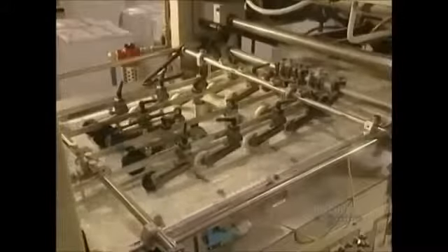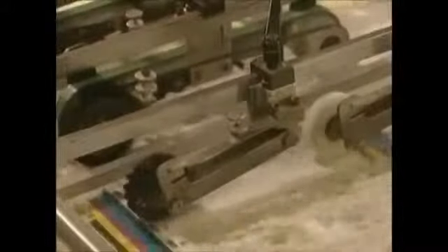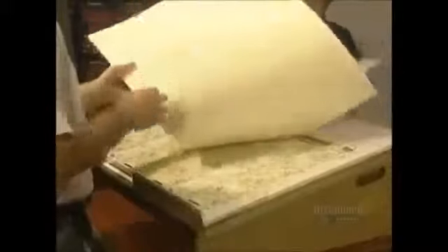This enormous pile of 3,000 sheets is ready to be cut. The embossing press feeder handles between 6 and 8,000 sheets an hour. Rollers guide the sheets in the direction of the press, and here the sheets are embossed by the machine. The precision of the embossing is then verified.